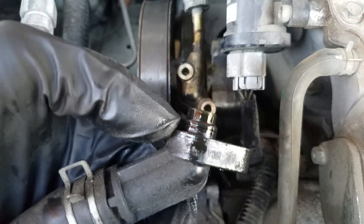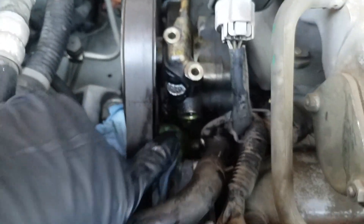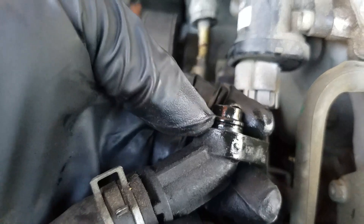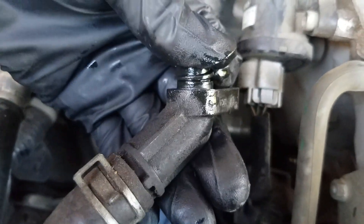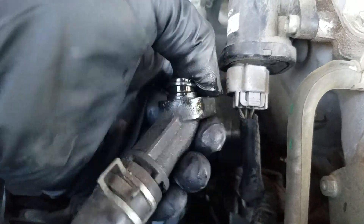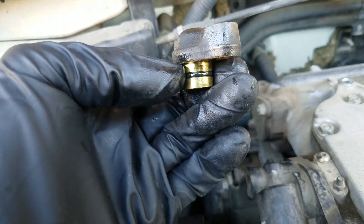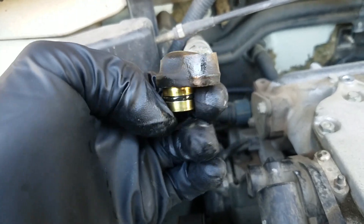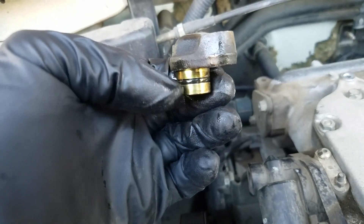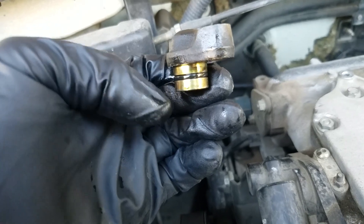When you pull this out, you'll see the O-ring sitting on here. If it's not in here, make sure to look inside — it might be stuck, just pull that out. This one should slip off pretty easily, but this other one sits in a recess. So when you're pulling that out, if you can't get it out with your fingernail and you decide to use a tool, be very careful that you don't scratch this surface or underneath this seal, because it'll have a hard time sealing if you do.